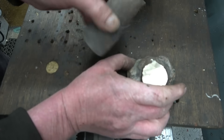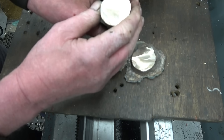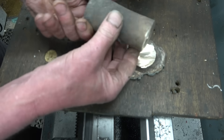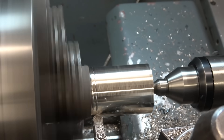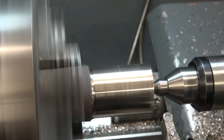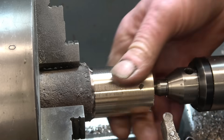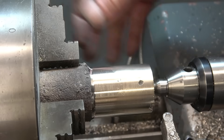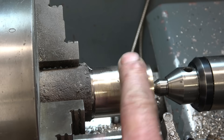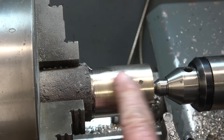That's the bronze - I've just cut the top off with an angle grinder, lovely and clean. I'll put it in the lathe and give it a quick skim to see what it cleans up like. There are still little parts where the sand hasn't formed properly, but it's really clean, nice solid metal. With a little bit more time and better molds, that's perfectly usable bronze stock. It is the real stuff - I'm very happy with that.